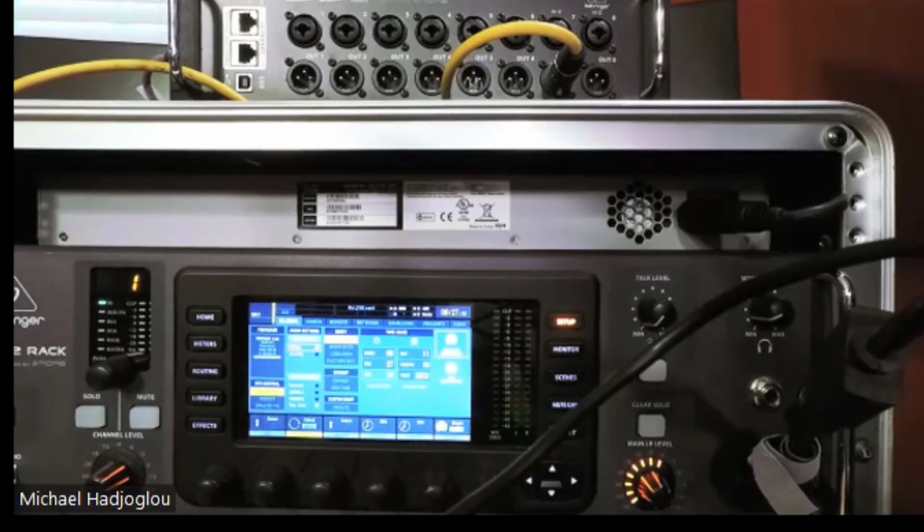I'm going to kill that real quick, like you said. Okay. So we've got 3 switches on the side of this guy. We have 1 through 8, we have 9 through 16, and we have 17 through 24. So like I said before, these SD boxes don't have IP addresses. The X mixer that is shooting data out to them doesn't really technically know that they exist from an output standpoint. So we have to put them on the right port, and then we have to configure them on the device side for what signals they're going to take in and push out.